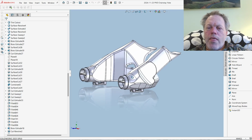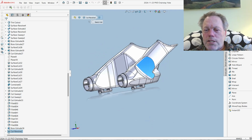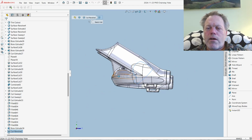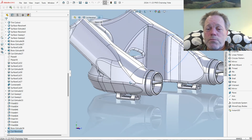And that's a really nice way to do that because, for one, that area here that I said had the big cross section, it increases that cross section, which helps us. It's also going back to where you need it. Like if this came up to the front, well, we don't necessarily need it to be supported up there. That's just holding the two sides together. So we reach all the way to the back where the connection happens, and that's going to help support the stay tubes even more.